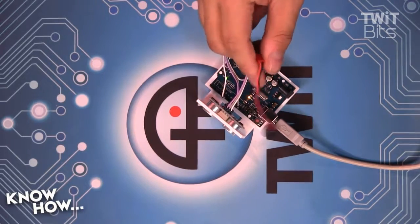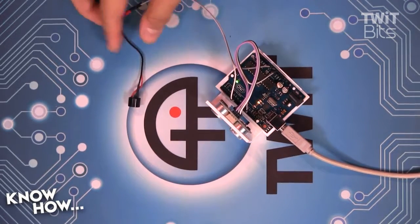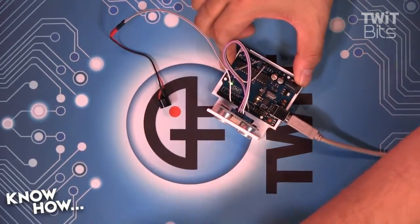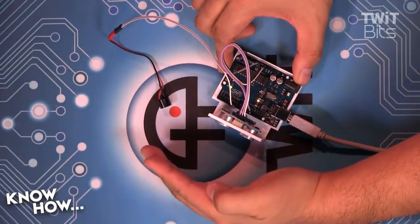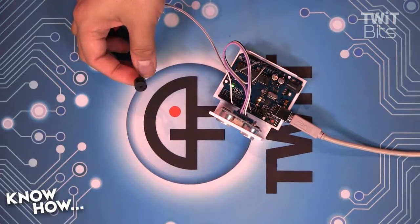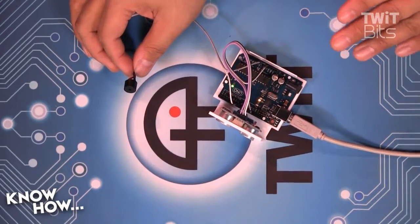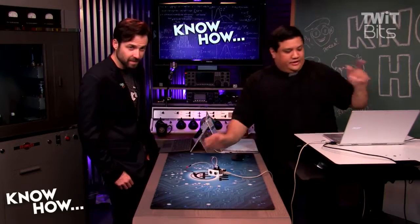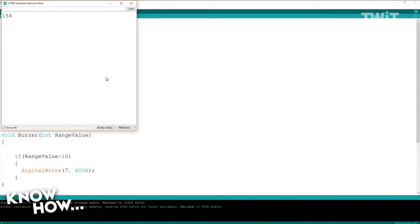This is the buzzer from a quadcopter, and I just have it wired into ground and pin 7. The way it's going to work is: as soon as I get within 10 centimeters, you back away and it turns off. The ultrasonic transducer will work exactly the same — it's the same principle. I'm running it straight off of the Arduino; they don't even need any additional power. If you go to my screen, I'm going to show you what this looks like. This is showing me what distance it's detecting to an object, and as I get closer you're going to see those numbers going down. I have it set for 10, so as soon as it passes 10 — there you go — beep beep beep beep. Then I release it and it goes away.